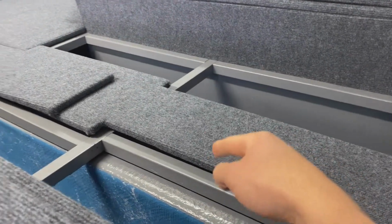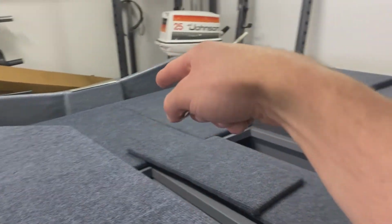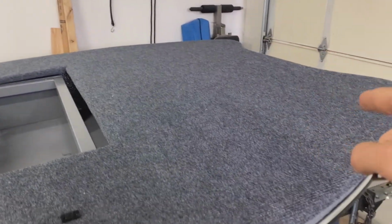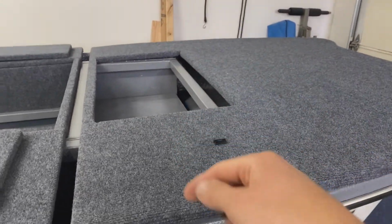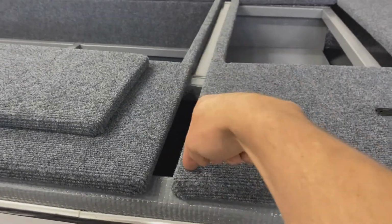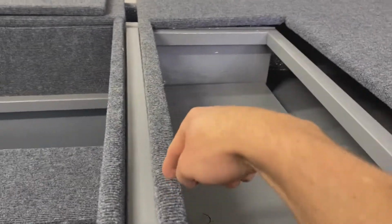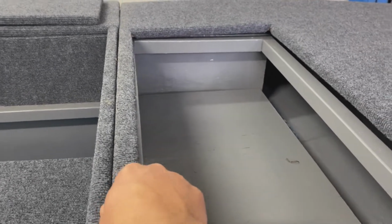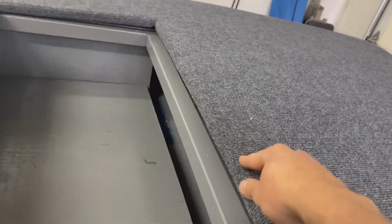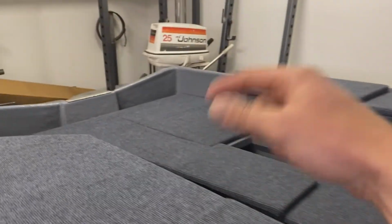And then I have to fasten all the stationary pieces, so I'm going to go ahead and screw this middle board down, the backboard. I'm going to work on securing the casting deck. I'm actually going to have to through bolt that too, so I have to drill some holes, put my little screw down through, and then nut it on the bottom. And then I'm going to have to screw it to the framing here too. It's far forward, but like there, and then this big old warp in this sucker. Hopefully I can pull it down okay and it'll stay down. Put some screws in there. So yeah, that's the plan for bolting everything down and putting the hinges on.